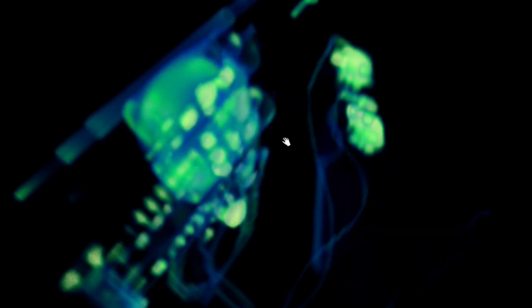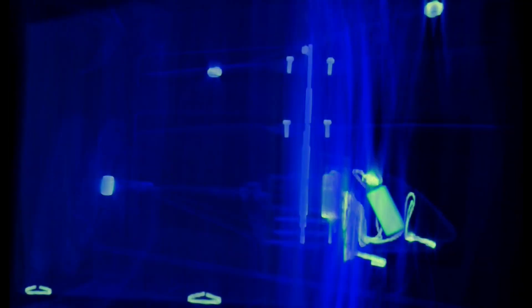We did a tomography as well, and you can see there are a lot of artifacts because we have very heavy material inside very light casings. If we want to pick up the lighter details such as the plastic on the blades, we have to lower the energy, but then this makes it very difficult to get through those heavy objects. Here in the 3D volume you can see the floating staples within the instruction manual, and you can also see the screws, motors, batteries, and some weights.